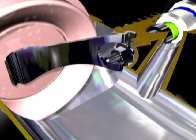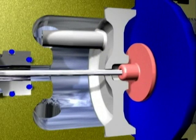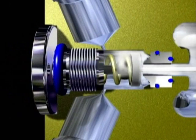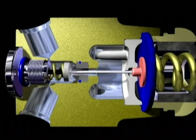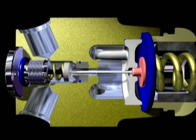During inhalation, air flows out of the balancing chamber, and the intermediate pressure decreases. It is the diaphragm that, by flexing, opens the valve, and allows air to flow until balance is restored. This is the basic principle behind the operation of MARES diaphragm first stages.